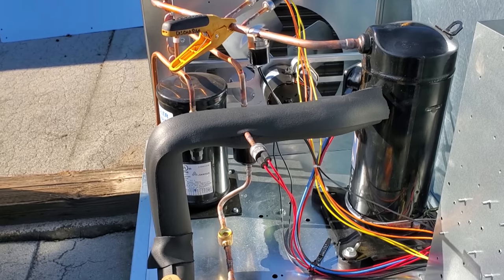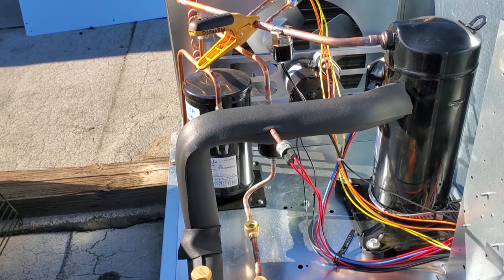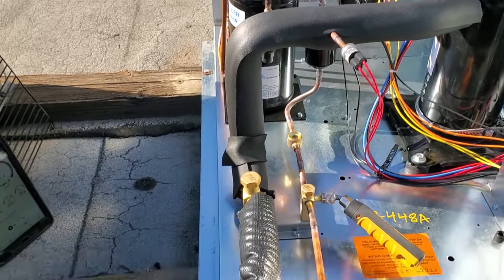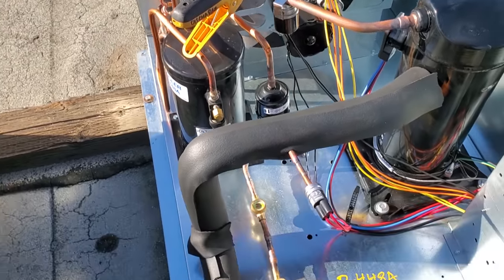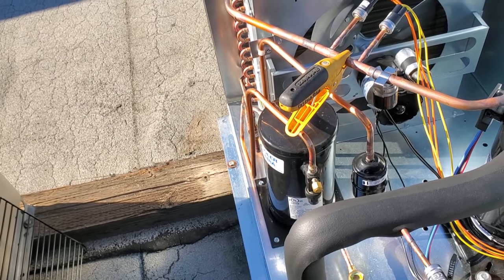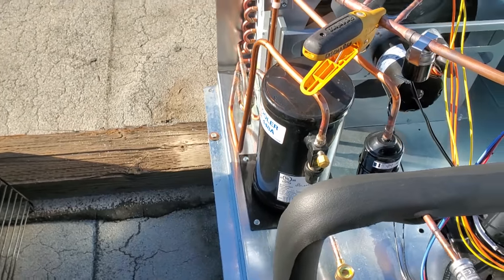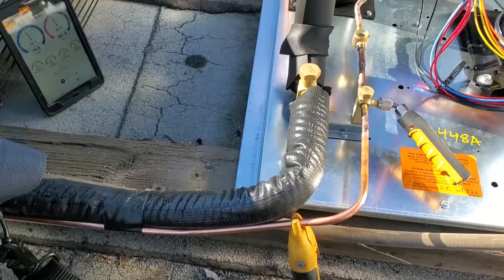We are probed up. Normally with a receiver you're not going to get a very good sub-cooling number. On the last one of these I did with that extra sub-cooling circuit, I had measurable 10 degrees sub-cooling after the liquid line filter dryer. We're going to measure here. Typically on the refrigeration side we don't use sub-cooling — we usually just clear the sight glass. You can use it as a metric for gross overcharge. Normally measuring just coming out of the condenser, I typically see three to six degrees sub-cooling.